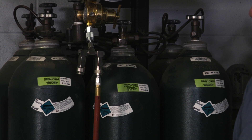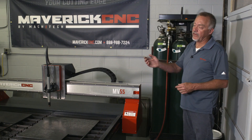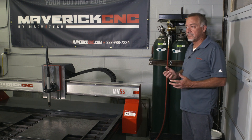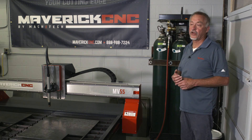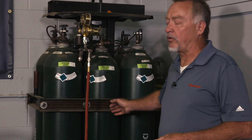There's no moisture in this air the way they produce it. This bank, if you cut continuously at 85 amps with a Powermax 85 plasma cutting system, you get about somewhere around six hours of continuous cutting time. That's arc-on time, and you couldn't do that in an eight-hour shift — that's probably two or three days of pretty busy cutting. So these do last a long time.